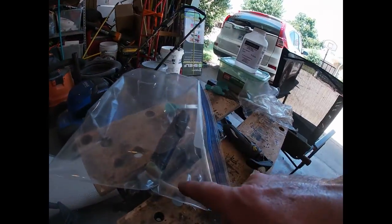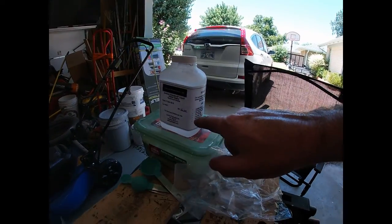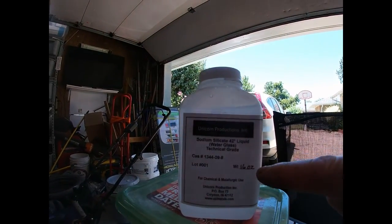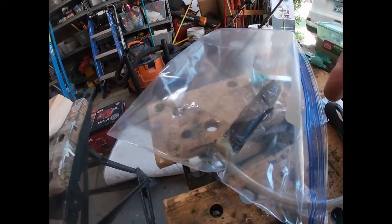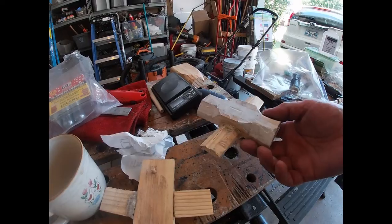I made my internal core and I'm setting it off in CO2 with my little thing here. I mixed it 10 to 1 — silica sand and sodium silicate. Made it wet, packed it in, hit it with CO2 to set it off. I've got my mold ready.